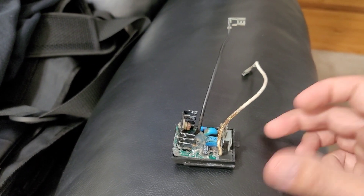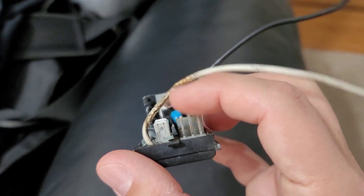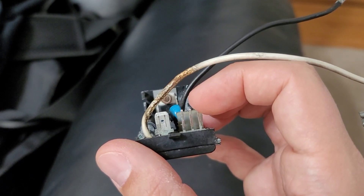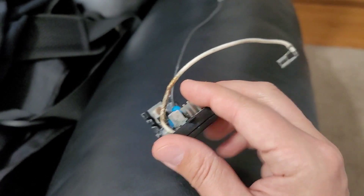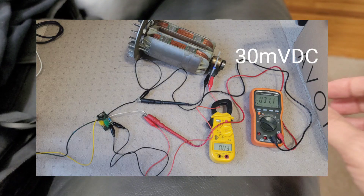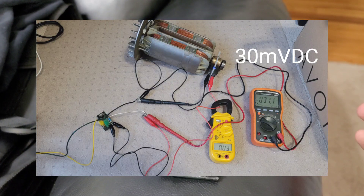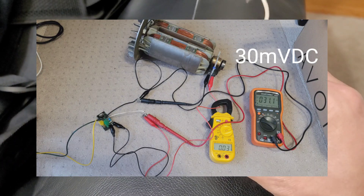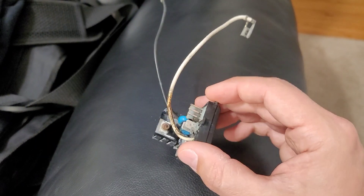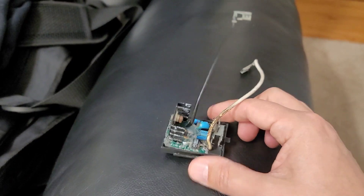There's always a test done to make sure your voltage regulator is working properly: take the two outermost pins of the three-pin snubber connector — it's a three-pin white Molex connector — and short them with a jumper. What should happen is that the regulator shuts down. You should see zero draw current on the rotor and no output voltage to your outlets — at most maybe five or six volts AC of residual magnetism. That's what the external system control board does to regulate the voltage: it controls the resistance between those two pins, so the brains of that circuit are actually on the other board, not this one.